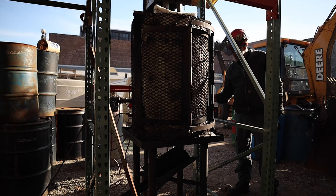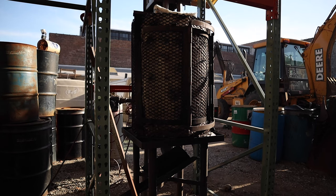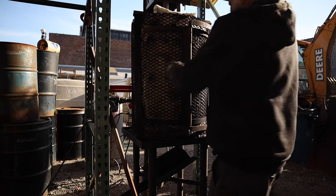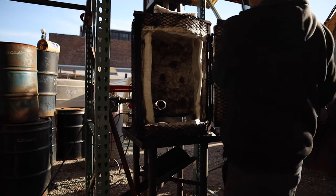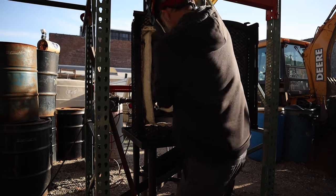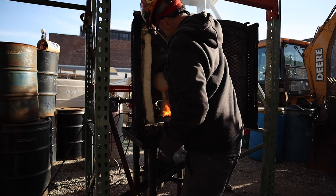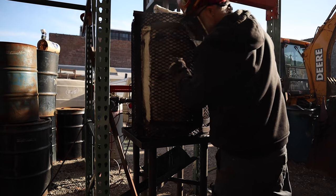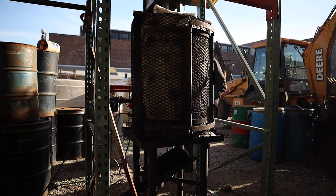Look at my temperature, I'm at about 1405. So I'm going to cut the burner into the main chamber. I want to do this fairly quickly, so I'm going to open up my door, set this first shell in, getting it to balance in front of the burner. You can see that wax igniting pretty quickly. Go ahead and shut this up and reignite the burner.